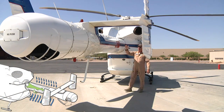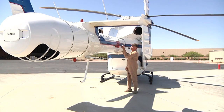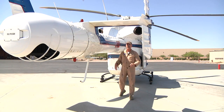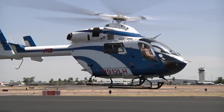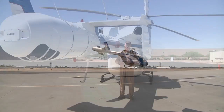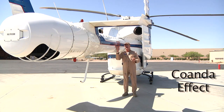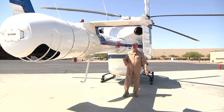It pumps air down the tail boom. In the tail boom, there's two slots running along this right-hand side. One here, and the other one right in here. The air is vented out from these two slots, and it creates a higher velocity airflow on this side versus the opposite side, creating a pressure differential, much like the Bernoulli effect on a standard airfoil. What it basically works out to, though, is a Coanda effect, it's more than just Bernoullian pressure differential, but it creates lift off to this side here, allowing for heading control.